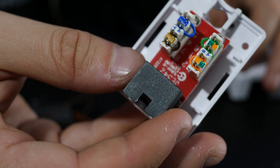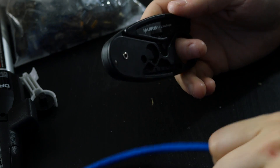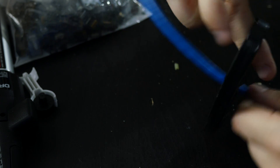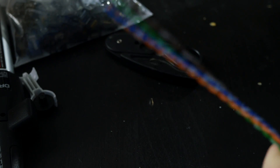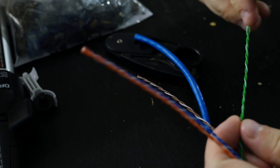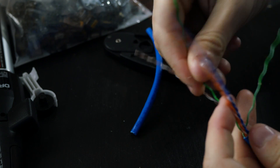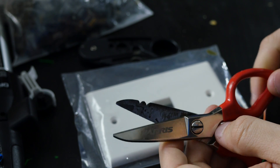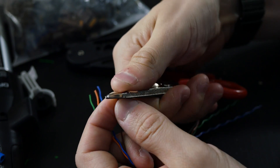That finishes off the remote end of our connector. Now for the surface mount box, I use a longer length of cable since we can snip off excess — it's not a big deal. We peel back an excessive amount of sheathing so we have a lot of wire to work with. Then we separate the solid wires from the striped wires, pulling the solid wires off to the side. Using a wire stripper — I have nifty ones on the end of my snips — we peel back and expose the copper.